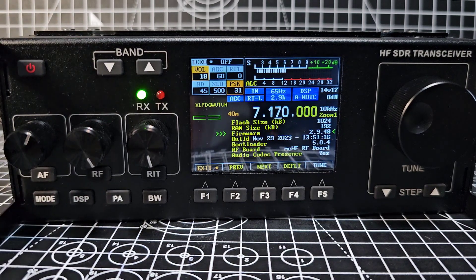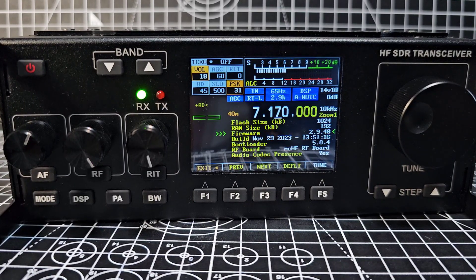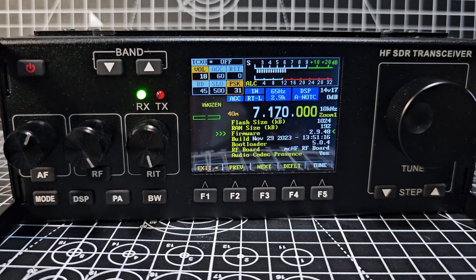2.9.40 and that's by Nizar. So it is a two-pronged process if you do it this way. If you buy one of these and they've already got the newer bootloader then you're fine — you won't need to do that. You just do the latter part where you put the new firmware on a USB stick, hold down one of the buttons and the power, and it just loads. But if you need to add the bootloader then that's a bit more complicated. Remember: when you load firmware you're going to wipe all the settings, and these devices need to be calibrated otherwise they'll overheat when you transmit.